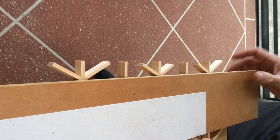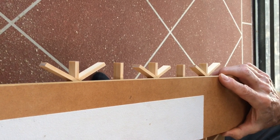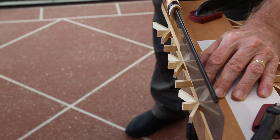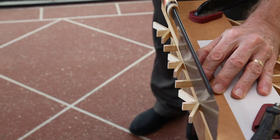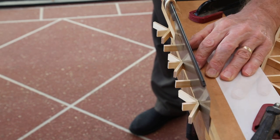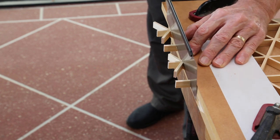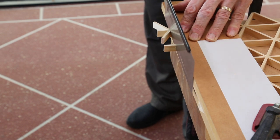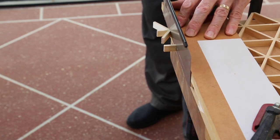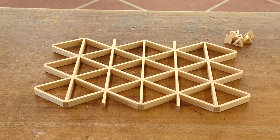The cuts for the top and bottom are made in the centre of the joints. When cutting off the top and bottom, take extra care with the single Kumiko pieces — these are quite weak and will snap off if the saw catches, so take your time and don't rush. Either before or after cutting, place a pencil mark on the Kumiko to indicate the front top. And we now have the Jigumi cut to size.